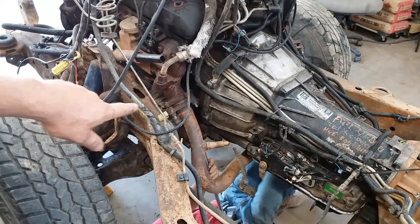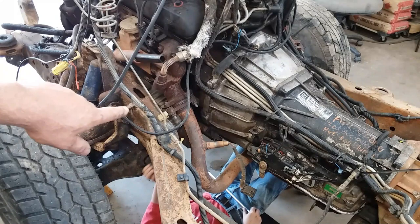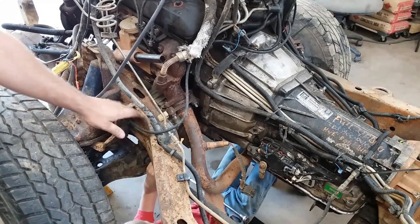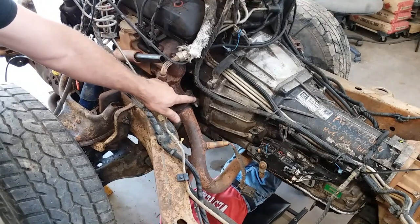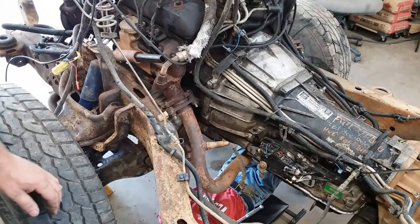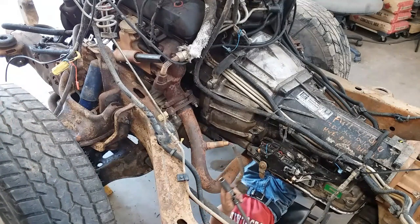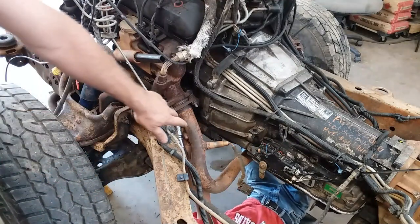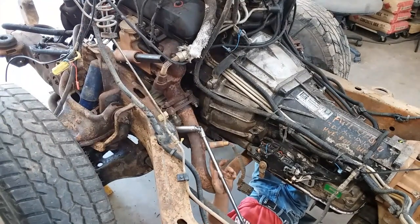Now, you should really expect to twist these off — these are not a lot of fun. I wouldn't even try these unless I had a cutting torch handy to where I could heat the nuts up, because usually these studs are rusted almost in two, and as soon as you put a socket on them, they're going to twist off. So that's just something to know. Now, I've had this rig apart a couple of years ago and you can still see the remnants of the anti-seize. I absolutely goop everything with anti-seize when I put it back together.